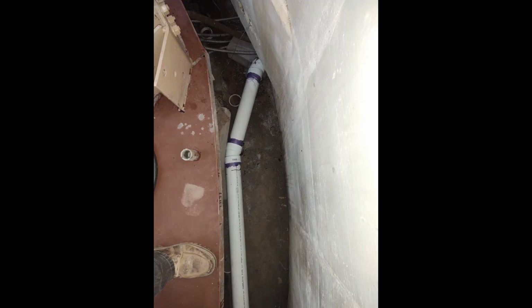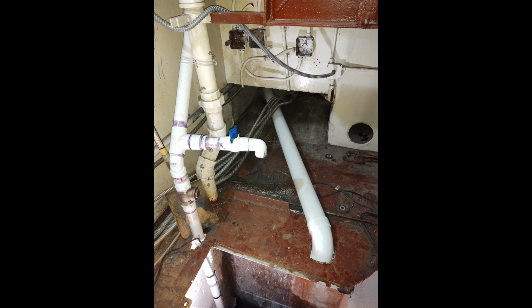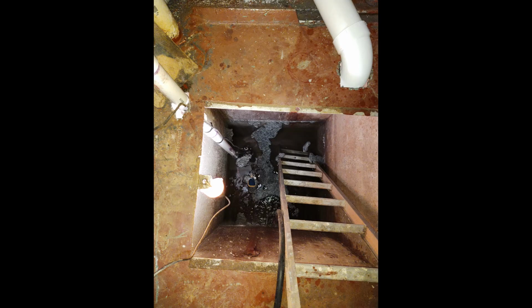And there you can see we've got a 4-inch drain line going down to the bottom as we're going over to go out to the bottom of the stairwell to the sewage sump. And there you can see we're building her out. Eventually there will be another mirrored image bathroom on the lower level, but for right now we're just leaving it as one. You can see that 4-inch line coming in and going through the top plate for the sewer sump, and then that's looking down into it.